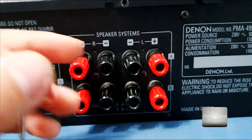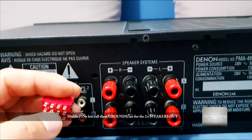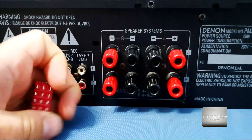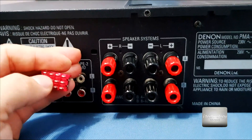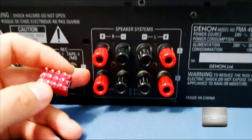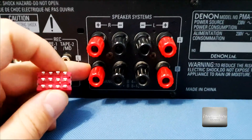The grounds are separate for the amplifier, so do not unite the grounds on other relays. The grounds must be separate, the channels must be separate from one another — the grounds from each other, the positives from each other. These middle pins will be the grounds. If these pins take the signal from the receiver, the output goes to the speakers. This switch will connect those pins to the grounds. One set of pins will go to the cut connection inside the motherboard, and one set will go to the external connectors. The upper side goes to those connectors, and the bottom side of the switch goes to the cut motherboard.